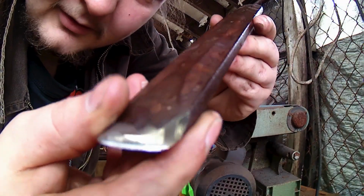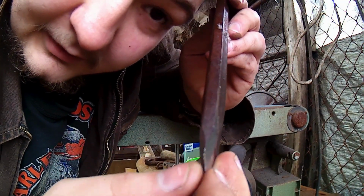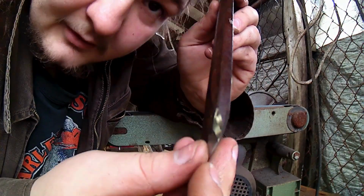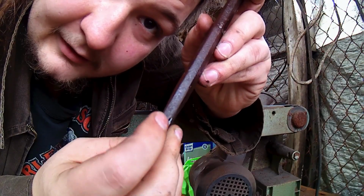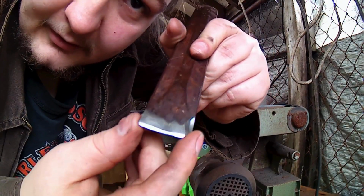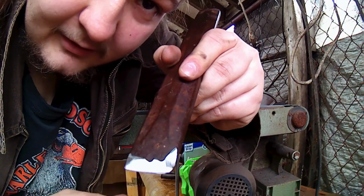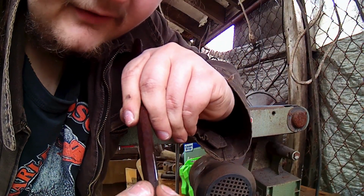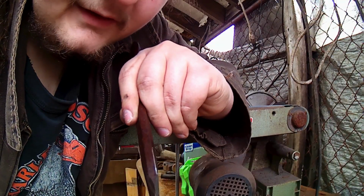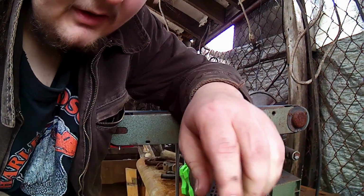Alright, guys, so as you can see, there is our two bevels coming in there. I don't know how well you can see it. Okay, there you go. Right in there. And then our main taper, and you can see how it kind of digs in there on the side. I like to use that for leading the cut. You know, you get a nice fine edge to aim with, so that you know where the edge of the chisel is going to go. And like I said, it helps clean up the cuts on the ends.